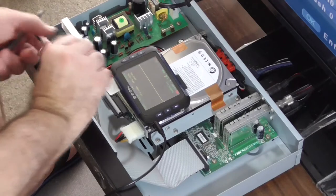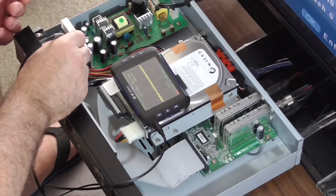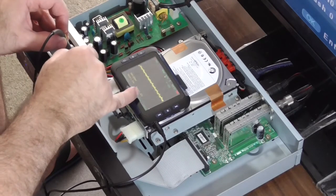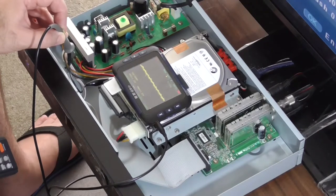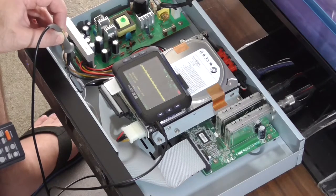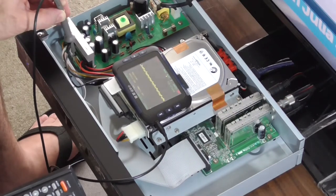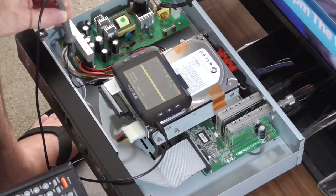I can just measure that power supply, I suppose. Put that onto the chassis. And 12 volts we've got. Actually, that's a hell of a lot less noise than I had before. So a minimum of 11.3 and a maximum of 13.2. And 3. Start up a program. So that's playing. So the 12 volts definitely got more noise in it. It's quite a lot of noise, 5.8, nearly 2 volts of noise on it.